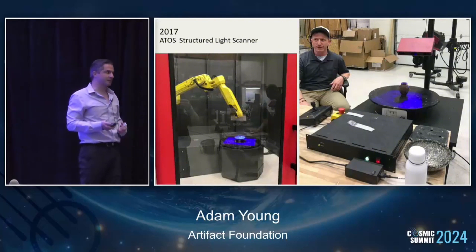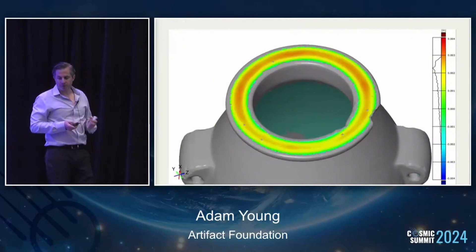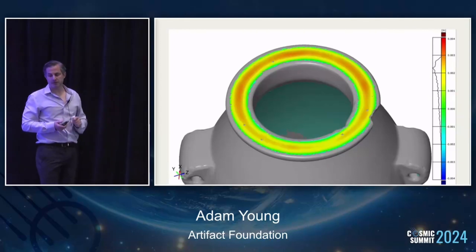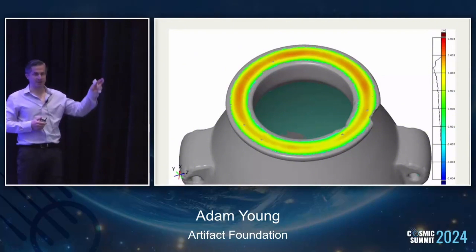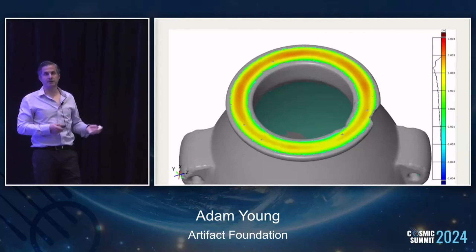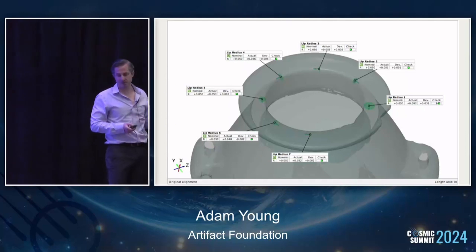Nobody really knew what to expect. I was a little biased because I did think these were made with some sort of technology, but I didn't know to what extent and we didn't have any data before. We created reports on a few of these vessels, looking at key components like the top, the sides, a few very simple things. This is that first red granite — or OG — vase. The top looks flat, but it's not. It actually has a radius on it, resulting in a convex lip facing down. That radius is consistent across the entire top surface. In fact, every single surface of this vessel has radii. The roundest circularity at the mouth is incredibly tight — down to about a thousandth of an inch, one thou.